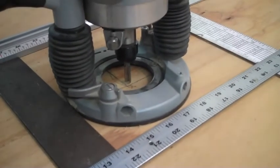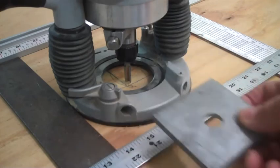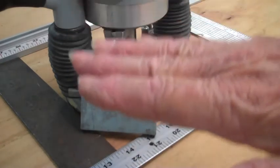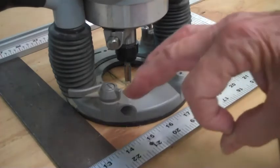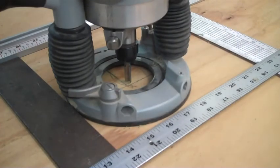And this will help me. I'm going to recess this quarter inch thick steel plate into the tabletop, and that's going to have the 5/8 inch through bolt that holds all this mess together, and I'm going to keep that as compact as I can, the distance between the bolt that supports the bottom and then thereby supports the ball bearings in the top. I don't want a lot of room because the bearings that go around the edge and roll around the perimeter of this thing, I don't have a lot of room to put the through axles through to hold them in place.